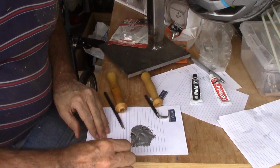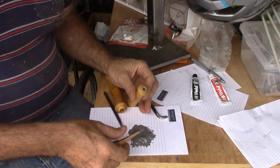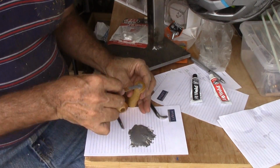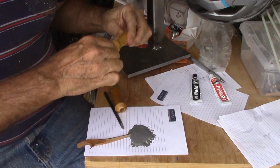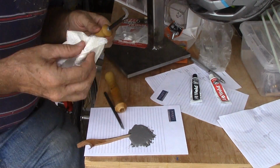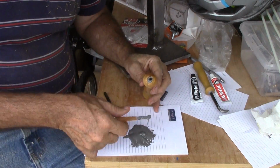With the length of these tools, they're good for hollow forms up to about 3 inches in height. My tools are ready. My investment consists of 2 old large Allen wrenches and a couple of scraps for handles. Next, I'll test them.